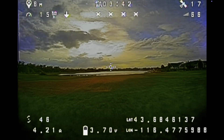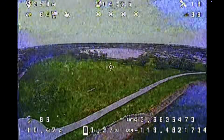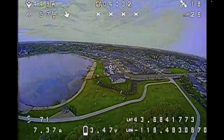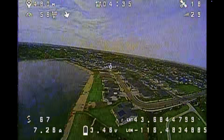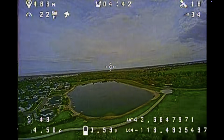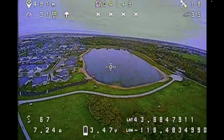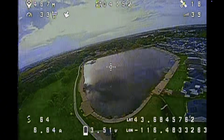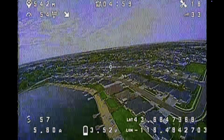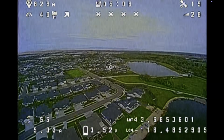Lastly I want to talk about the camera and video transmitter range. The Caddx Ant is on the lowest end of the spectrum for price — you kind of pay for that, as you can see. The VTX antenna was mounted in front of the battery, so once I started getting far away it became really apparent that the battery was blocking the video connection. When I turn around the battery blocks it, but as soon as I'm facing myself that antenna is facing me and it becomes a whole lot clearer. I was only able to get 600 meters out, which is further than you'd think, but I think it would be a lot more impressive to get at least a kilometer out, and repositioning that antenna would do it.